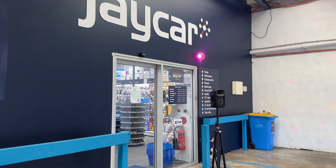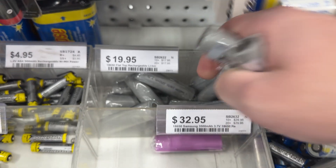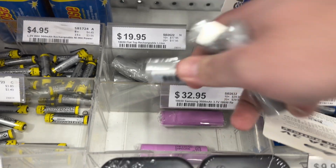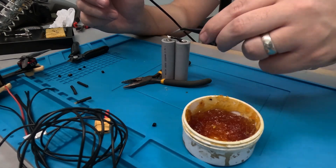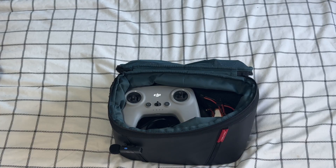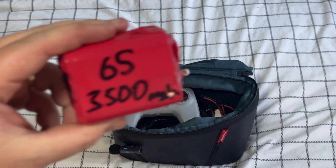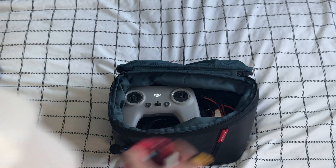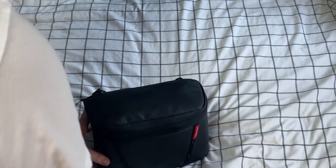We can't just use any normal field pack — after all, they're going to be too big and clunky. Luckily, 18650 batteries can do the trick. We're going to need a 6S 1P lithium-ion pack, or 2P if you want, and you can either buy this or make it yourself. The math works out that if you get a 3,500 milliamp-hour 6S lithium-ion pack, you should be able to charge around seven packs from empty to full. With the FPV go bag all ready to go, it's time to take it out and fly and see how many packs I can get in.